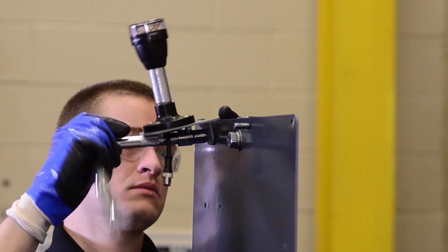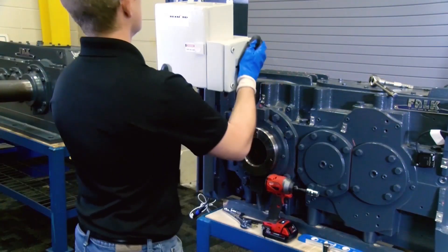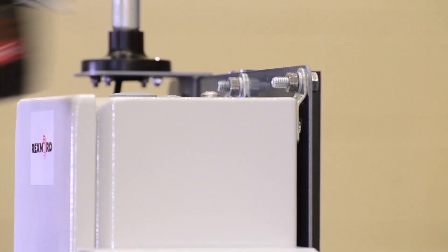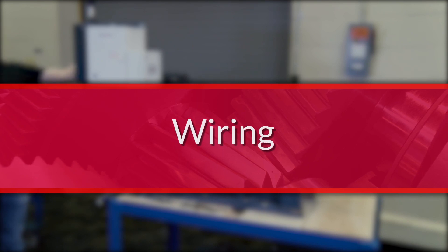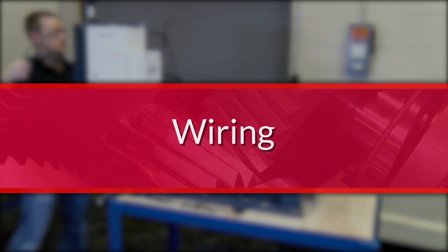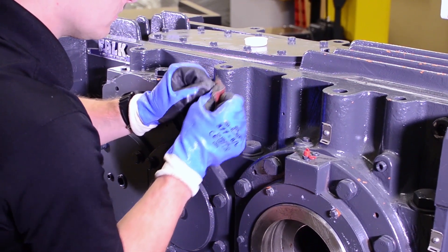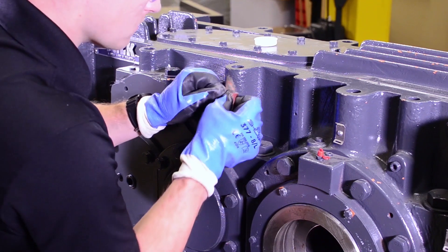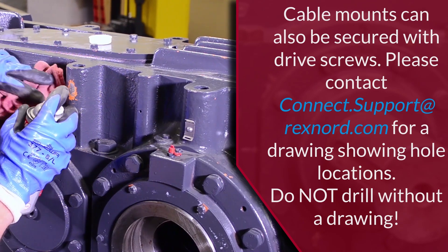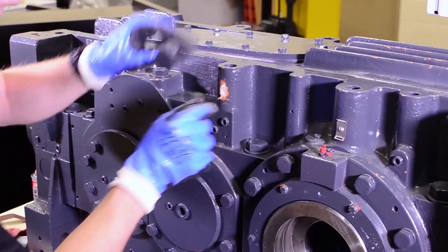Use the channel nuts with ½ inch hardware to attach the edge mounting plate to the Unistrut. Attach the andon light assembly using the 5/16 inch bolt and lock nut. Secure the edge device to the mounting bracket using the provided 5/16 inch hardware. Cable clips will be installed on the drive and will be used to secure the sensor wires to the gear drive. The housing will need to be sanded and cleaned prior to mounting to ensure proper adhesion. Use the provided two-part DEVCON plastic welder to secure the cable mounts in place.